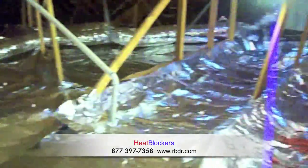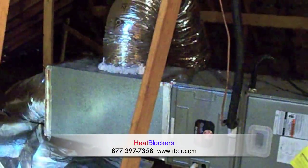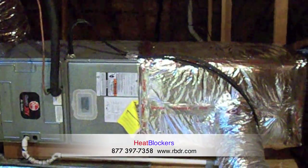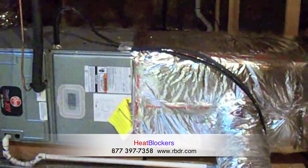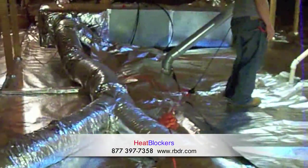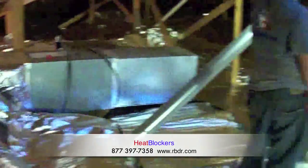Everything has been completely covered. Making our way down here, you can see the plenum on this side has been sealed as well, all the ductwork. If you notice the white foam — with the way the ductwork was situated, the DAP was going to be the most effective in this particular application. We do custom fit everything for the house individually. You're going to notice a significant difference in the temperature out of the registers, because of the plenum being wrapped. And they're not going to have any more condensation dripping down from the plenum because there's no more bare metal exposed into the attic.